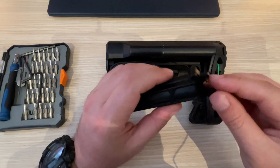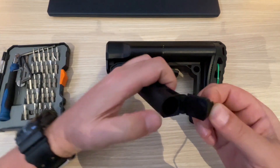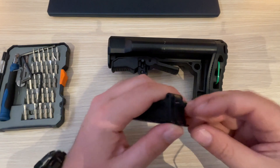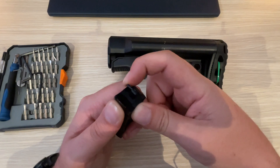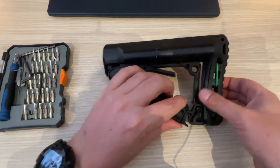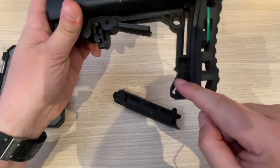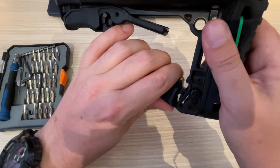Where you want to start is this bottom piece — this is obviously the one that opens, and there's your tube for putting stuff in. There's a pin here; it's basically a press pin or roll pin, and that is designed to slide in this groove that you see here, so it'll be locked inside there.